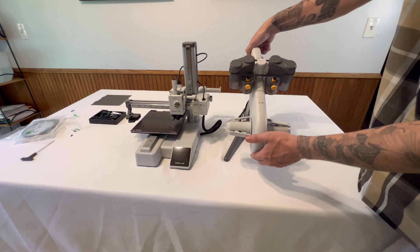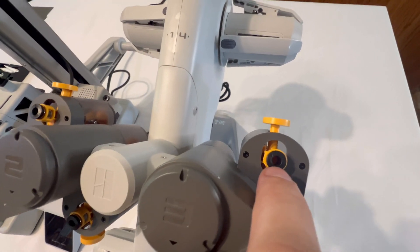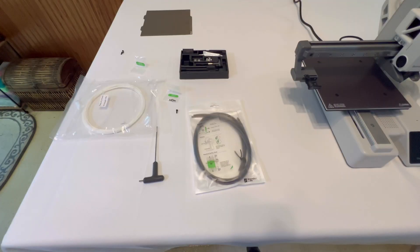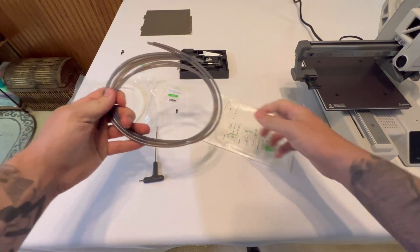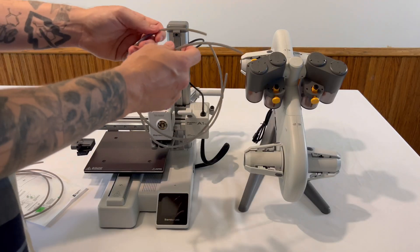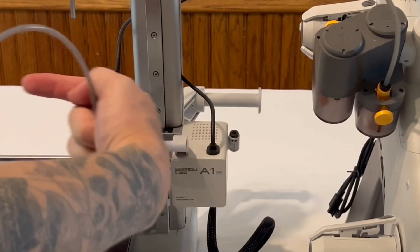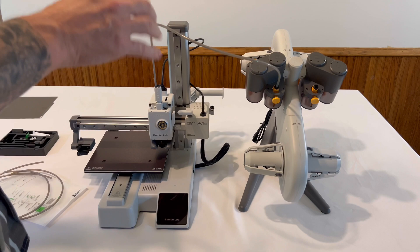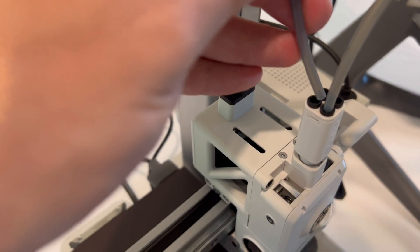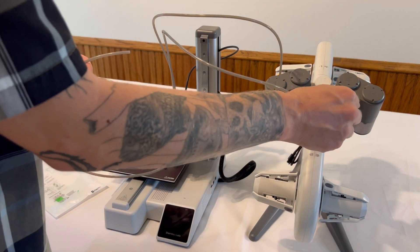Move the AMS unit to around 8 to 10 inches away from the printer because we're going to install the PTFE tubes. These little tubes go from the AMS unit all the way over to the printer head — this is what the filament is fed through. Grab the bag of PTFE tubes — there should be four, and two of them are longer in length because they have a farther reach from the AMS. Grab the two shorter tubes for the inside of the AMS since it's a closer reach. Push these PTFE tubes gently in and they will snap and click inside. That click is a special fitting that allows the tube to push in but not pull out without pressing down on that fitting. Install the shorter ones on the inside and the longer tubes on the outside.